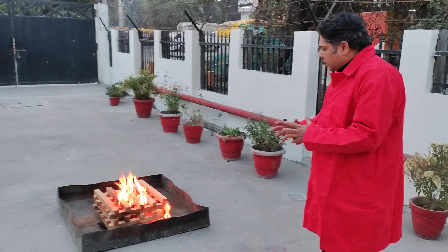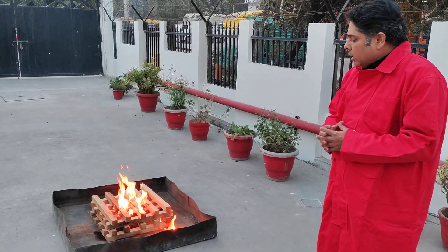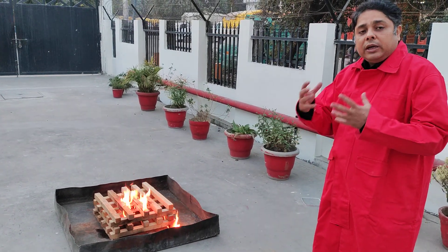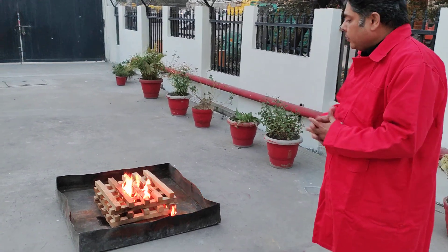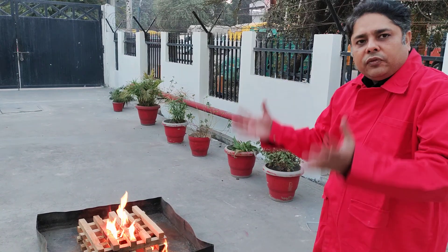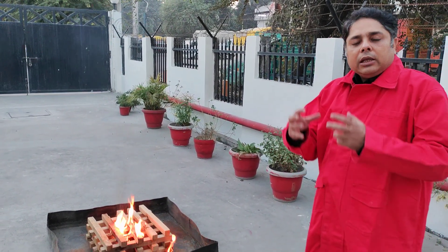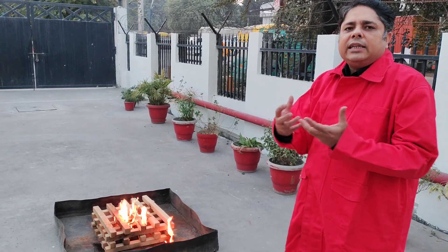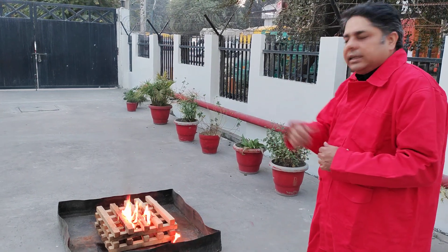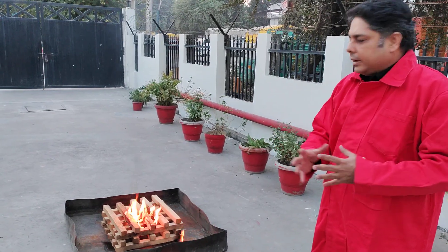As we wait for one minute, the heat is going to go deep into the wood — it is going to be a deep-seated fire. When I use my water mist on this, it is going to rapidly cool the fire source down. There is going to be a lot of steam which is going to envelop and smother the fire. The fire is going to be extinguished with the effect of the steam, and the heat taken out from the source with the water converting from liquid to gas — which is latent heat of evaporation — will cause the fire to cool down and not reignite.